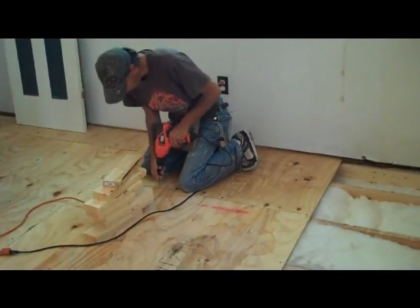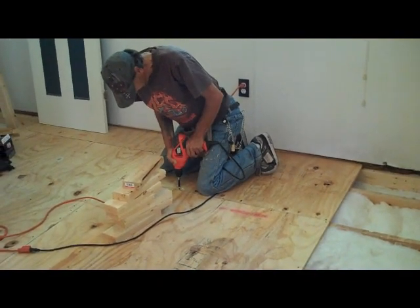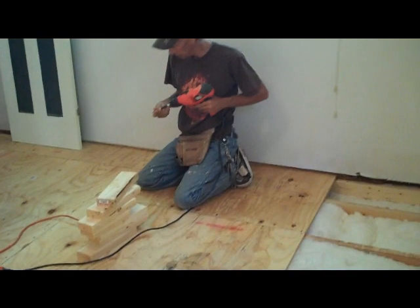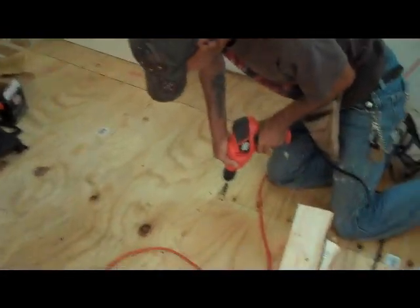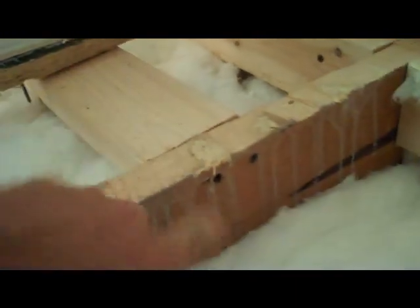So easy — Billy can do it. Alright Billy, you can do it. In the closet, I couldn't frame under that wall and I needed framing on both sides, so I just framed through it. I took my 2x4 and went all the way under and put some screws here, back around here, put some screws here. That gives me something to screw plywood to when I put it in.